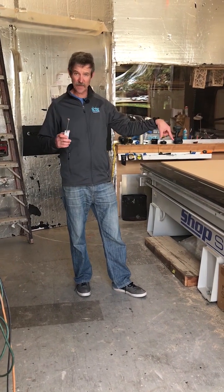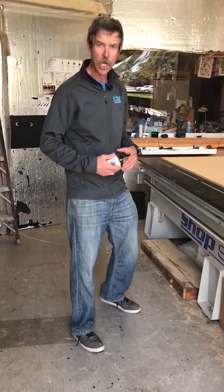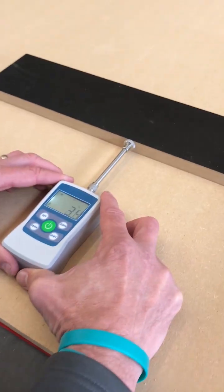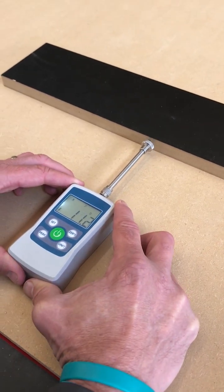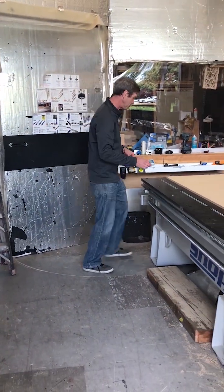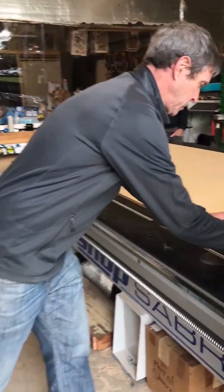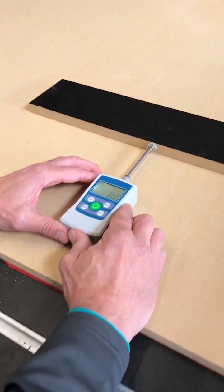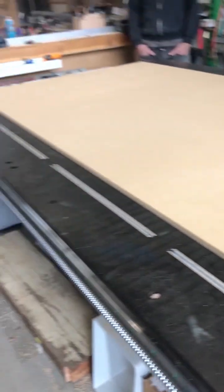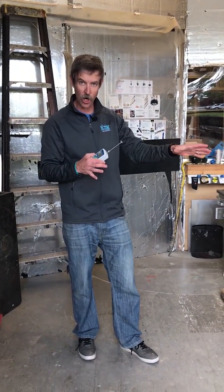Now that we've got the gasket in the table itself, we're going to see what kind of vacuum performance improvement we get, because we're eliminating that leak under the spoil board. With all four zones on, same part — 11.2 pounds of pressure. We've more than doubled the holding power with the four zones on. Now down to one zone to increase vacuum efficiency — 37 pounds. About a 50% improvement by gasketing that one zone for leak prevention.